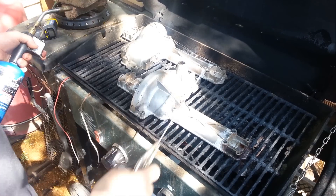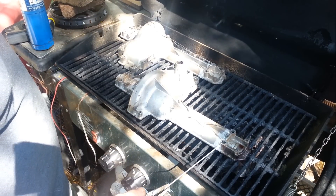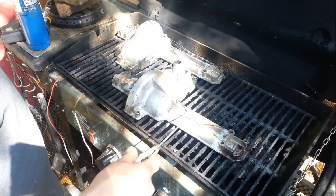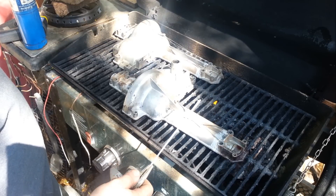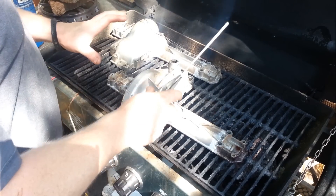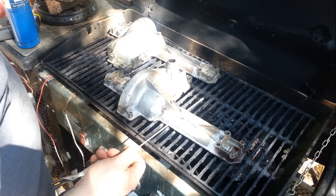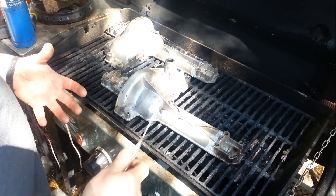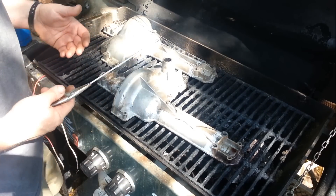I've got these going on the barbecue, and the reason is — unlike steel where you can heat up one little area and weld or braze it — aluminum transfers heat so fast that if you try to heat up one area, by the time you try to apply this brazing rod it's already cooled off. You need to heat up virtually the entire piece. The other thing is you cannot tack weld with this — your pieces need to be in position because once you get it up to temperature you're going to apply this and it'll just flow almost like solder.